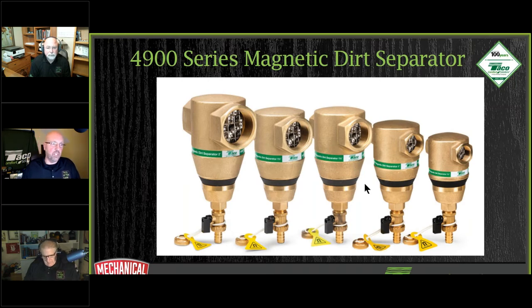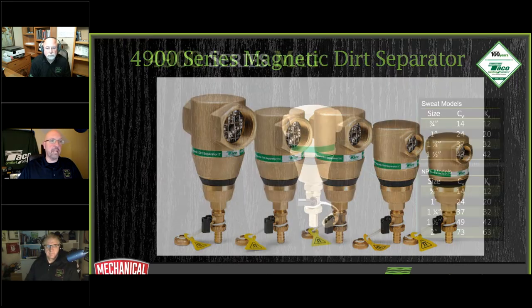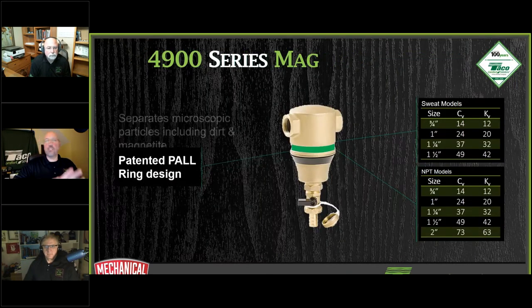to collect any magnetite, which is your rust in the system. Whenever you have dissimilar metals, with cast iron or iron pipe in a system, and cast iron circulators, we're going to have rust. We want to make sure that we take care of it, and it doesn't have to be done chemically. We can do it with the magnetic dirt separator here, using that same idea.